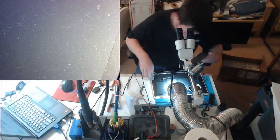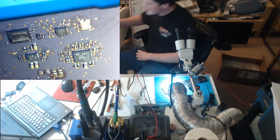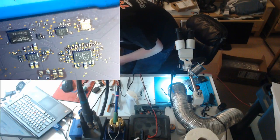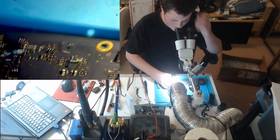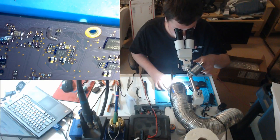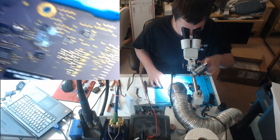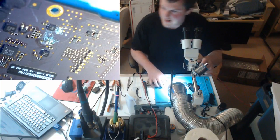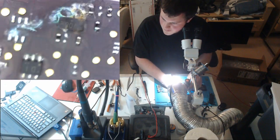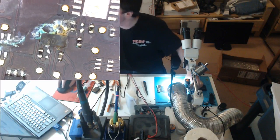This one looks real nice. Probably just such minor liquid damage again. That's close. Clock chip is close enough. But in this case, our clock chip looks beautiful. Looks real nice, doesn't it? So, have a look right here. That looks real nice, doesn't it? Well, what does that do? That is BIOS I2C. You're getting closer, not quite.